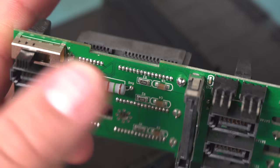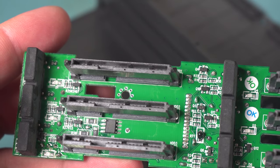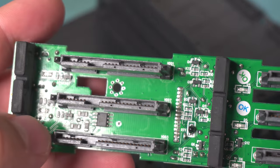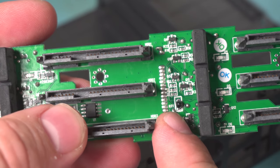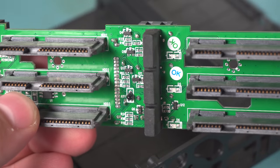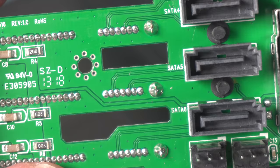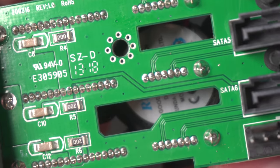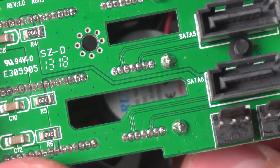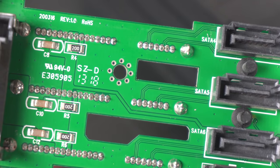No idea what the HY539 chip is other than it might be a regulator. It just says HY539 on it, so no idea. If anything it's just powering a little circuit to run a tiny thermistor which does all the temperature sensing. It looks like there's a transistor per LED for the detection of drives, and that's about it — the board doesn't have much on it. These oddly shaped cutouts are the only source of airflow for the drives other than a little gap on the top and bottom. When the fans are installed they actually block most of the opening with their motors, so the airflow just isn't very efficient.